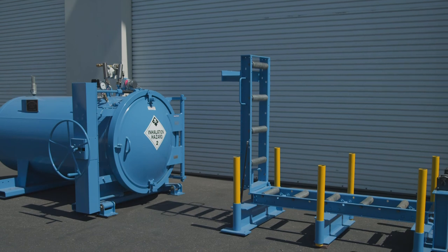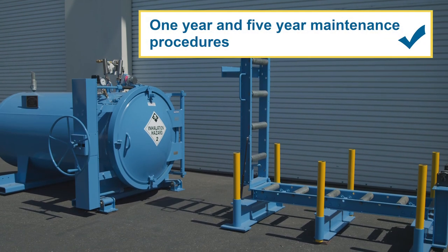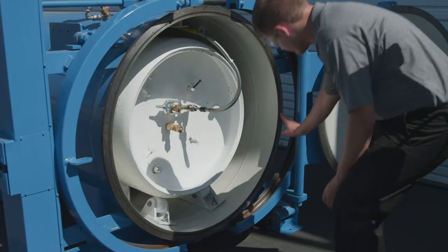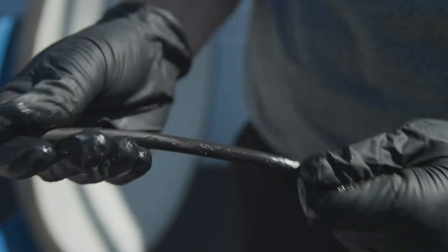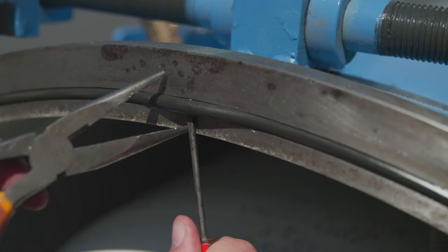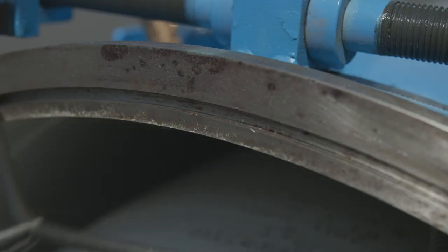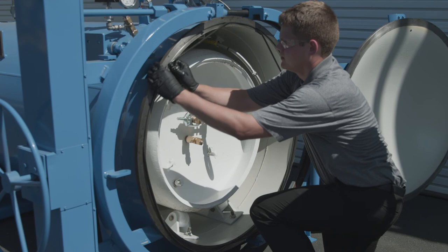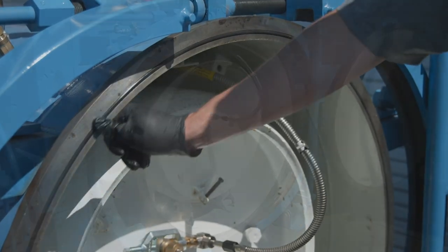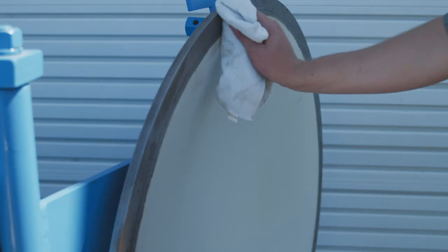In this video, we will go over the one-year and five-year maintenance procedures required for the proper upkeep of Clortainer. With each cylinder exchange, visually inspect the Viton O-ring. The O-ring should be lightly coated with halogenated grease, and we recommend replacing it annually or if it shows any excessive wear or deterioration. Visually inspect both sealing faces of the closure with each use of the Clortainer. Keep the faces clean by wiping them with a soft cloth and then applying a very thin coating of halogenated grease to prevent corrosion.